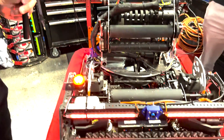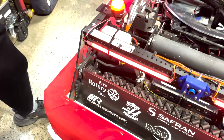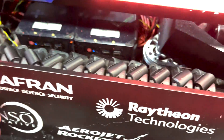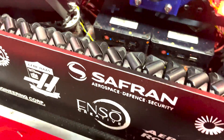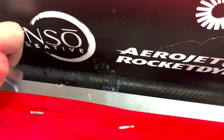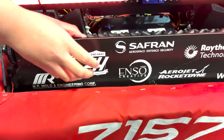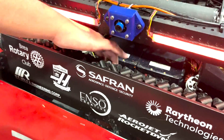All right Zach, go ahead and take it away. Yeah, so let's talk about the intake first. Our intake is powered by a Kraken on a 3-to-1 gear ratio. If you zoom in over here under, we have our mecanum wheels that push it to our feeder. And if you see under here, we do have cat tongue for the first two rollers. This sponsor panel also helps us with compression of the note to guide it back in here.